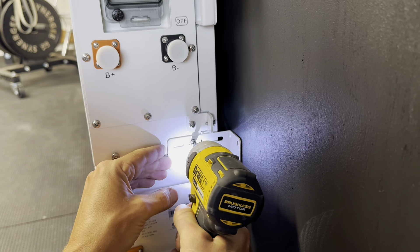Prior to getting our side panel liquid-tight conduit connection in place, we need to configure each battery ID, which is done with these dip switches. I only need to configure three batteries, so I just use the manual — you can do one on top or one on bottom, whatever's your preference. The communication on the controller: I could add 16 modules in parallel, but today just three. Now you can see what I mean about it being nice if there was a built-in conduit controller box. But remember, this is built for outside use, so everything inside that protective cover is technically water resistant. One other gripe: there's only one screw securing this panel — in addition to how it snaps in — I think there should be a screw at the bottom as well.